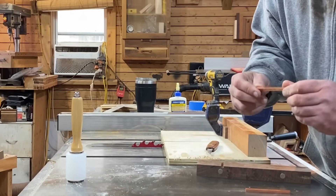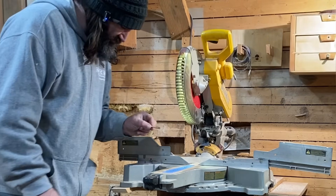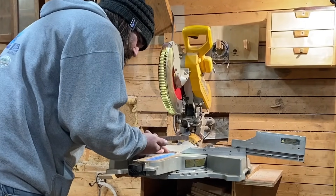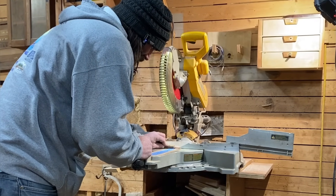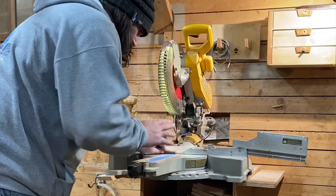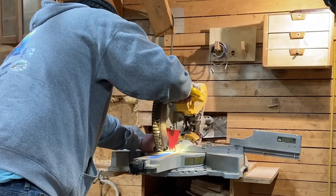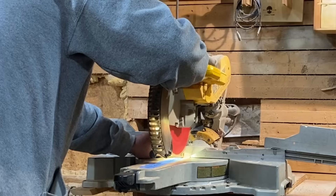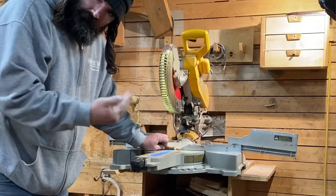So let's go ahead and mark out our piece of copper where we need to cut it. Let's take this over to our miter saw. Whenever cutting small pieces like this — especially copper, brass, or even aluminum — I like to take a piece of wood and use that as my holding piece. I'll set it right on top of the piece that I'm gonna cut and actually cut right through the wood as well, because that just tends to help it stay in place and make a nice smooth cut. Take this cut nice and slow, do not rush it, let the blade do the work. And there you have it — perfect.